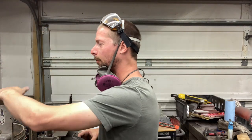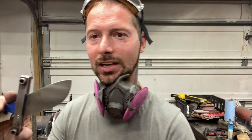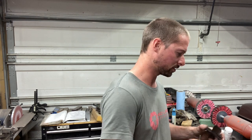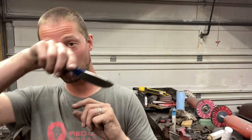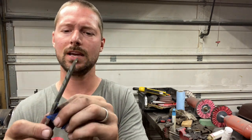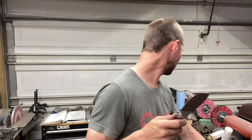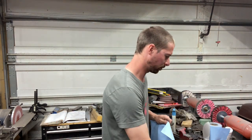Just a few passes with the Trizac belt, then a couple passes with the really coarse surface conditioning belt, and then the worn-out surface conditioning belt. Now I've just popped off the file guide, and when you pop your tape off you get just a really nice clean finish. This really does work pretty good for me.